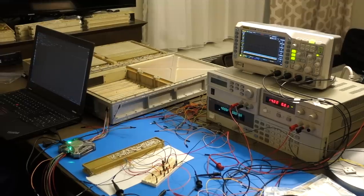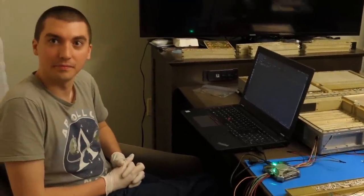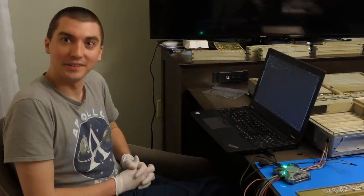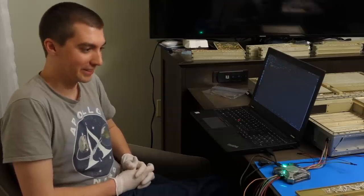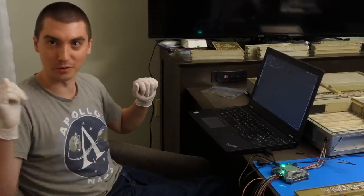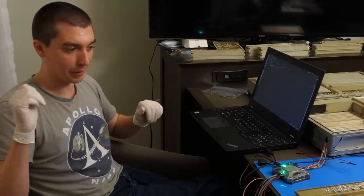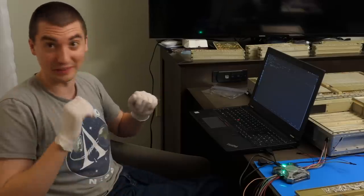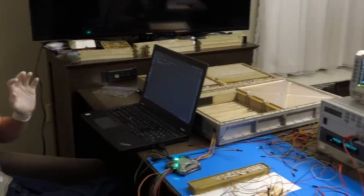It's the warning integrator, and it's watching for things that happen that are unusual, and it only triggers when it's unusual, but unusual too often. So the computer was designed to be able to take restarts or dropped counter pulses and things like that, which is fine if they happen occasionally, but if you get a whole bunch of restarts in a row or drop a whole bunch of counts, then that's actually a serious problem. So this is watching for the too frequent problems.